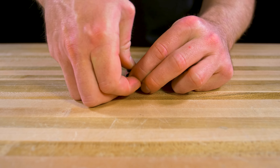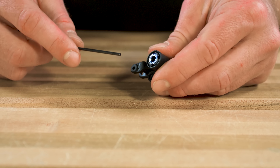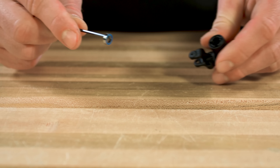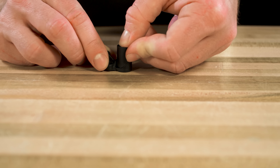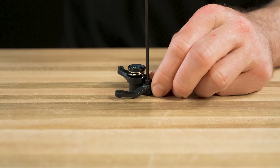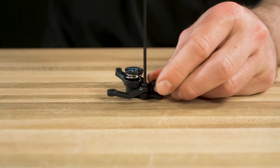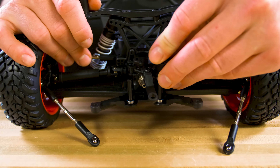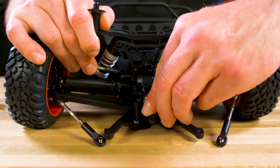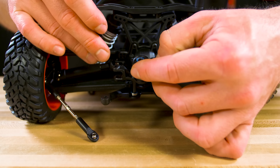Here's a tip: use some pliers or the flat side of another tool to compress the spring — this will make reassembly easier. Now put the nylon composite pieces together and put the spring in place with the rim side facing up. Press the ring down onto the spring until secured. Use the original bearing and press it down into place on the newly assembled post. Assemble the outer post by snapping the pieces together and inserting the original bearing.